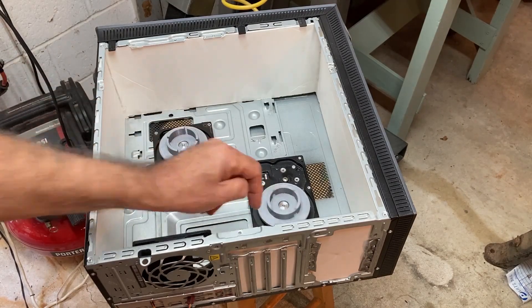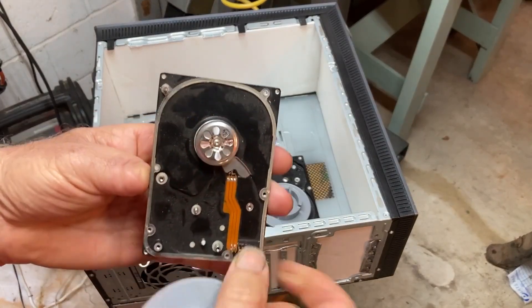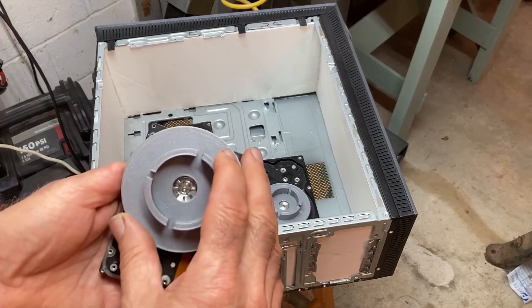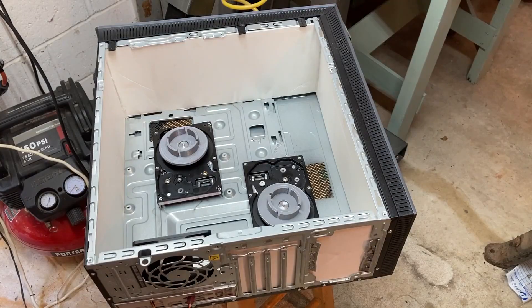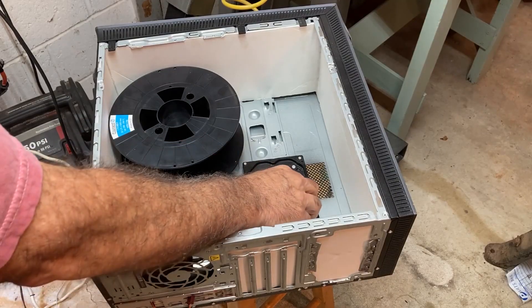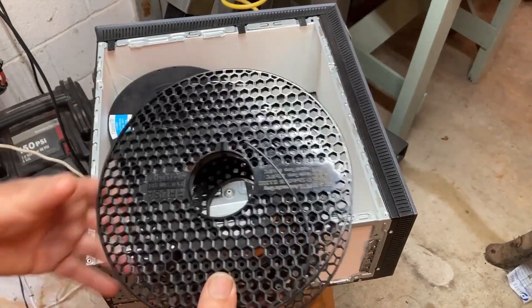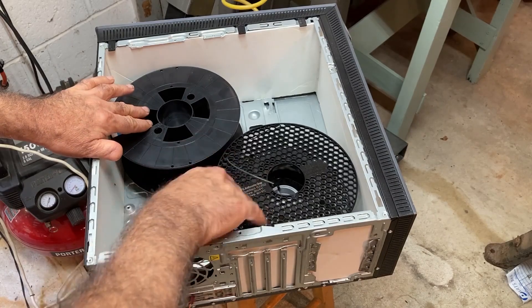The smooth rotation is ideal for that purpose. With some hard disk drives, the bearing diameter can be quite large compared to others, so we would modify this in our CAD program to accommodate our various spools. We'll show you what it looks like — putting in the first spool, it sets in there and rotates very nicely. We can swap these out depending on the brand of spool and their diameters, and now we have a second one that rotates nicely without really interfering with the other one.